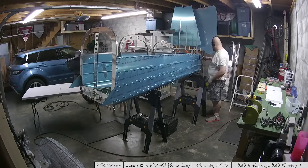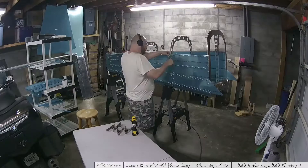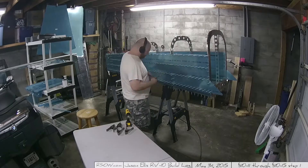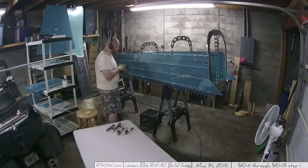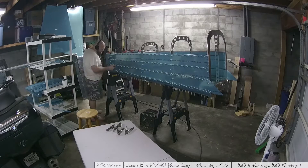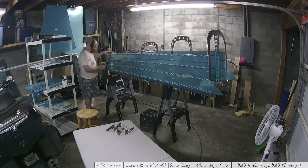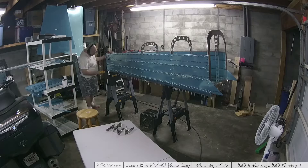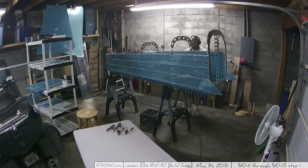The irony is you're going to have to do it again. I went ahead and pre-drilled all these like I thought I was supposed to, and I think it even says to, but once you put the top skins on you've got to do it again. You have to drill on either side of the cleco, then move the clecos over and drill all those holes — tedious.